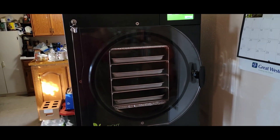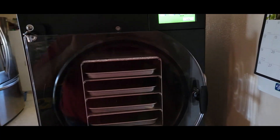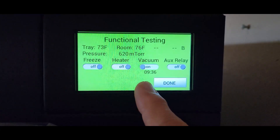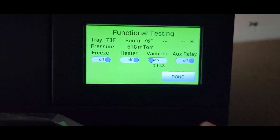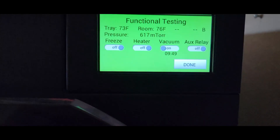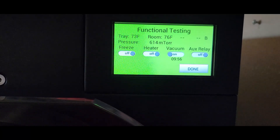We went through and did the off-gassing procedure — 14 hours on heat, then 14 hours with heat and vacuum, and it got down a little under 300. So this is the next day. I turned on just the vacuum to see if it's going to seal up. We've been running about 9–10 minutes, we're down to around 600 and dropping. We'll let that go, turn the pump off, and see if it holds. The next step is to change the oil and put some fresh oil in, which is on the way. If this doesn't fix it, we'll try the oil when it arrives.